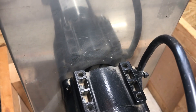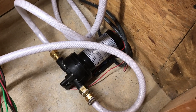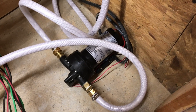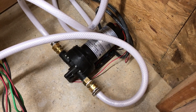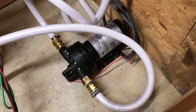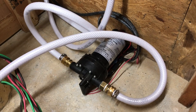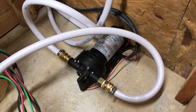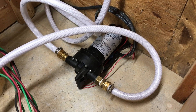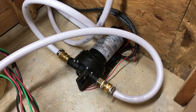The simple pump uses a roller cam inside on a special J-arm that lifts the sucker rods up and builds pressure. The booster pump for this system is an Aquatech pump — Aquatech makes multiple different sizes, shapes, and voltages. It's a very reliable pump; I've seen, used, and serviced these in commercial applications on large water systems in plants and for research pumps and various other things. I recommended Aquatech to Southern Prepper One.